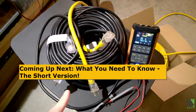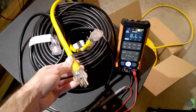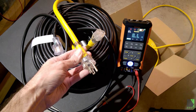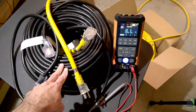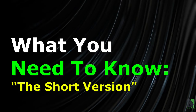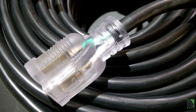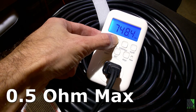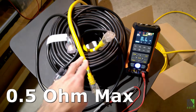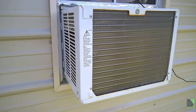The bottom line is that copper costs money, so a thicker cord costs a lot more than a thinner cord. To run any significant power — over about 600 watts — across 200 feet, you need to pay for a better cord. Otherwise you risk damaging the appliance and wasting quite a bit of power in the cord itself. My personal rule of thumb: I don't want to see more than half an ohm in any extension cord used to run a valuable appliance such as a freezer, refrigerator, or air conditioner. For something like a heater or light bulbs I'm not too worried, but for an inductive load, no more than half an ohm. Period.